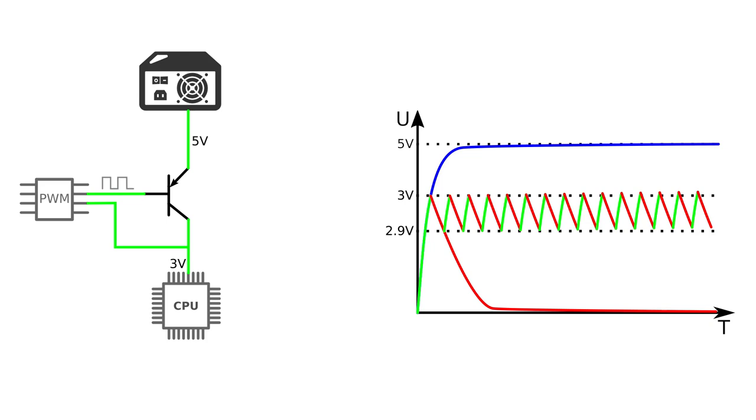But why did it become so useful? Where is the benefit to a linear voltage regulator, which I presented in another video? Well, the transistor heats up when it is turned on and cools down again when it is off. So instead of keeping it on all the time, like it is done with the linear voltage regulator, which has to dissipate a lot of heat, the switching voltage regulator always gets some time to cool down a little bit between the cycles. It still gets quite warm, but it is by far more efficient than a usual linear voltage regulator and so needs a lot smaller cooling solutions.